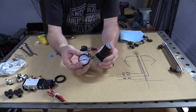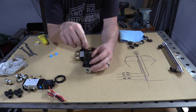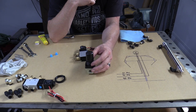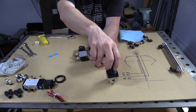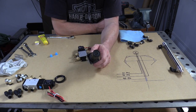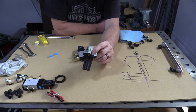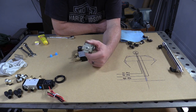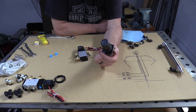This is a pressure regulator — I just have to assemble it, but this is how I'll control how much air pressure goes into each line, and I'll have three of these. The main airline from my compressor is usually at about 100 PSI. I'll have one regulator to drop it to 90, another to drop it to 40, and another for 30. The reason I don't just use the compressor's setting is that I'll likely have other props running, so I need 100 PSI going to everything and then use individual regulators to control pressure for each prop.